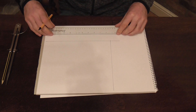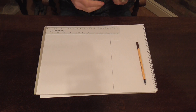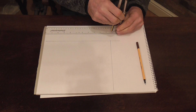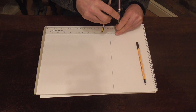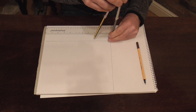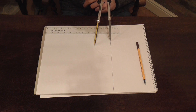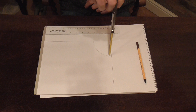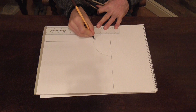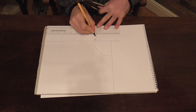We're going to be using imperial measurements which are inches and I'll also give you the millimetre equivalent. So first of all our first one is going to be the inside radius — that's 2 and 3 quarters in inches and 70mm in millimetres. Use either of those measurements and just scratch in your inside radius. And label that 2 and 3 quarter inch inside radius or 70mm.